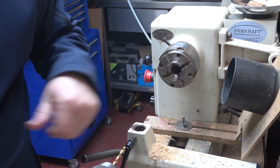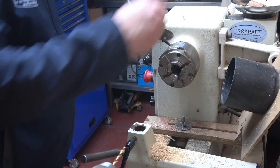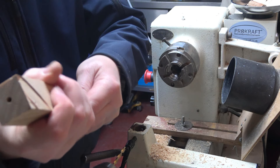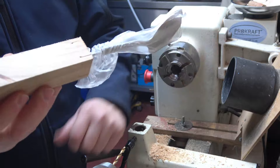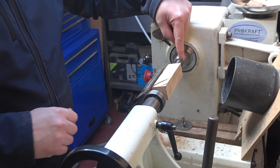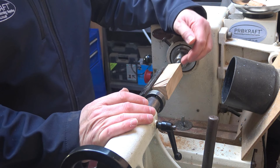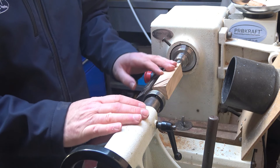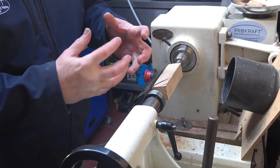So now what we have is a hole for the spoon at that end and a hole for the end cap at that end. I've got my dead centre at this end, my live centre at this end, and now we're just going to turn it to whatever size we want. The ferrule on the spoon end is eight and a half millimetres, but you don't have to get right down to eight and a half millimetres — you can just curve it down. I'm just going to turn a basic handle shape and then we'll look at putting it all together.